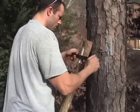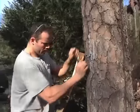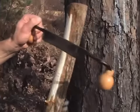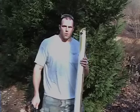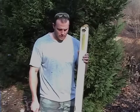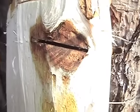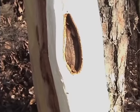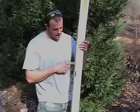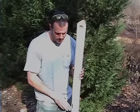When making a bow out of Osage orange, I start by removing the bark to get a better look at the condition of the underlying wood. After removing the bark, the stave looks pretty good. However, there's what looks like a saw cut near one end and a spot where another tree may have gouged the bark. So I'm going to have to take all of the white sapwood off and go down into the heartwood to get to sound wood — I want a nice, pristine back.